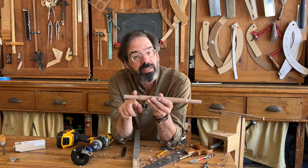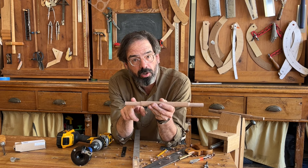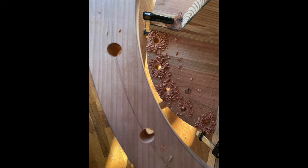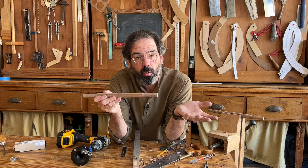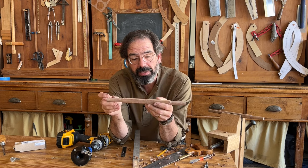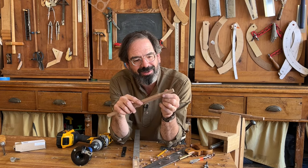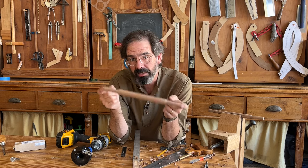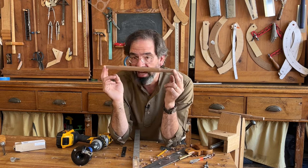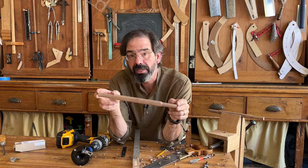There's a lot of flexibility with these tenons. If I need to put a tenon through an arm that is an inch thick, I can trim it off at inch and a quarter so it goes into the arm. If it needs to go through the seat, I can leave it at full length or take off a quarter or half inch to get it to inch and three quarters for a through tenon in the seat. I can also use these in a low back chair where long tenons go into the backrest, getting a lot of contact and joint strength. Whenever I find enough stock to make twelve and a half inch long sticks, I just burn through the stock, make a big pile, and all these sticks are ready to go into almost any chair that uses short sticks.